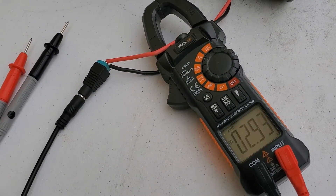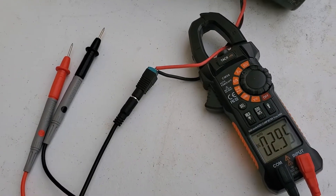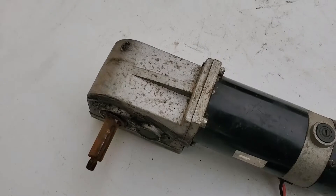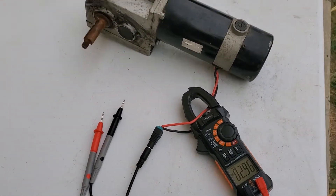After removing the electromagnetic brake, I hooked it up to my 12-volt, 5-amp power supply that I'll be using for the project and tested it out. It appears that the motor is working fine and drawing about 3 amps without a load, so it should be fine.